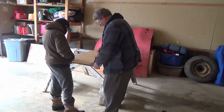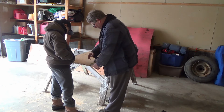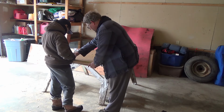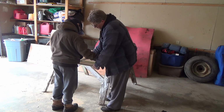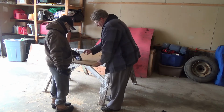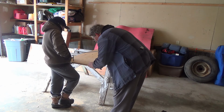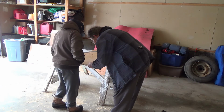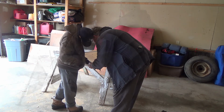So we're going to put a slot. Oh, so they can come off easily? Yeah, so we're going to put a slot halfway up. So first thing, let's find out how far it's halfway. So let's measure from the bottom. 2 feet. So it goes to 1 foot? Yep. Okay, so now we need to come over 3/8. I'm going to go a little bit bigger than 3/8.